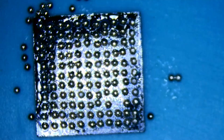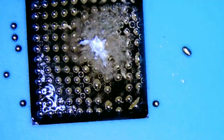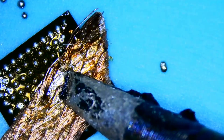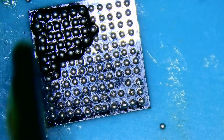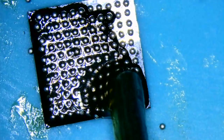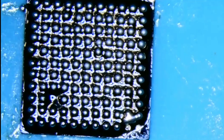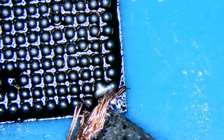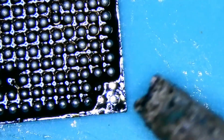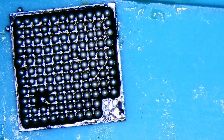A few balls bridged on that chip, so we're going to clean the chip off and try again. I've never re-balled anything — I'm trying to do it by hand with no stencil. 0.4 millimeter balls — they're freaking tiny. So here we go once again. I got another bridge down the bottom right corner this time, but being on the corner I'm going to use my desoldering braid. Hopefully I can just remove those four and redo those four, rather than trying to do all 121 again — because holy smokes, it takes a bit of time and patience to do this.